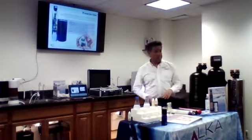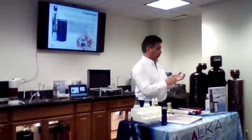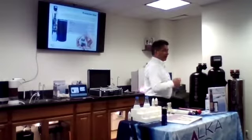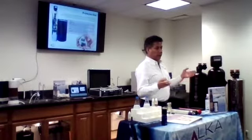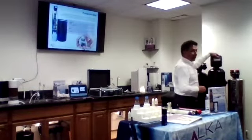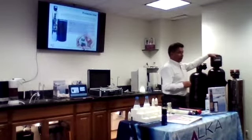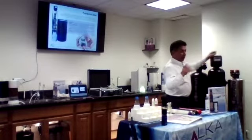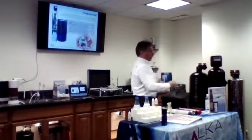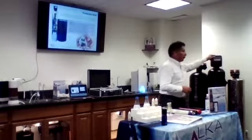But let's say on Saturdays the customer will wash their cars and do all the laundry for the week. On that Saturday, the customer uses 500 gallons, for example, and on Friday night the system only has 300 left. If the customer does the washing and uses 500, the system will be passing hard water.